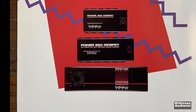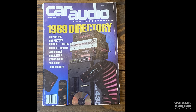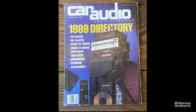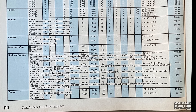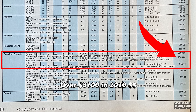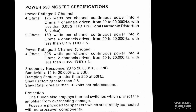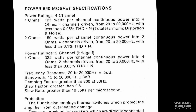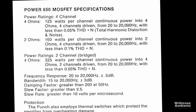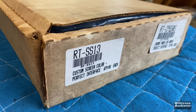Here is a late 80s — I think it's an '89 ad from Rockford Fosgate. You can see the three Power Series amps. Let's pull out the 1989 Car Audio and Electronics Directory and here we'll see the page for Rockford Fosgate. You can see the Power 650 is right there in the middle. $1,500 in 1989, that's equivalent to around $3,100 US dollars in 2020. The amp is rated 125 watts by four channels at four ohms, 160 per channel at two ohms, and you can bridge it down to two channels to get 325 watts per channel. It also has a high-pass and low-pass crossover selectable in the amp — that's 12 dB per octave.